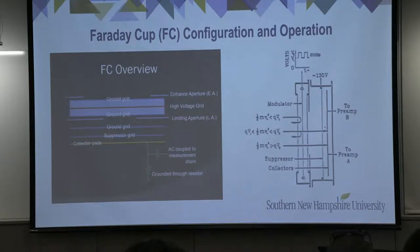These particle currents are filtered out within the signal processing electronics. It is the remaining particles, those with kinetic energies within the potential energies set by V1 and V2, that are of interest. This band of energy levels is called the energy range or energy window. Particles that enter the collector assembly pass through a series of grounded grids, and their charge is deposited onto a triangular or quadrant array of metal plates.